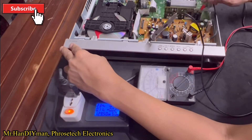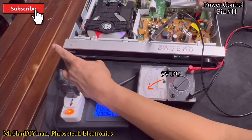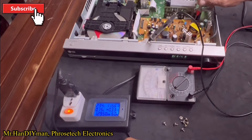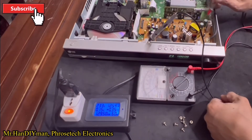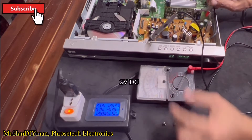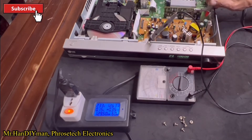At pin number 11, which is the power control terminal, it has 5 volts DC voltage command. But at pin number 124, which is the amplifier B+, it has only 2 volts DC output. This is not normal — actually, it must be 31 volts DC.